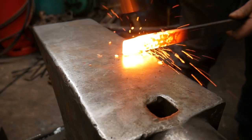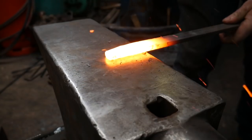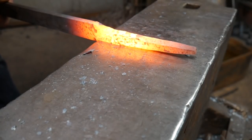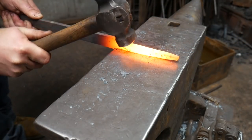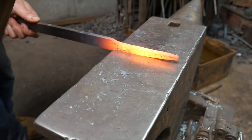When your material's hot, we're going to forge it down into a square section — taking the material down to 8mm square or 5/16 square. Work down towards your center dot marks. The best way to do this is to use a technique called heeling: as you get closer to the center dots, tip the hammer back into its heel, making the surface area smaller for more accuracy.